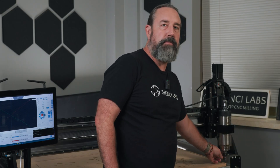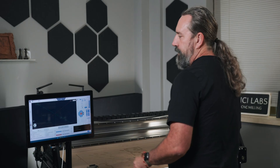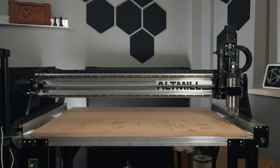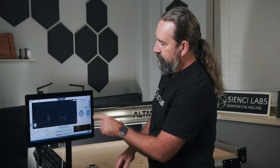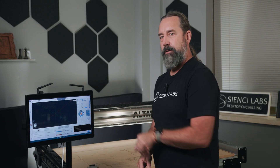This will be determined by the size of your bit. We have a 22 millimeter here — you may have something larger, one and a half or even two inches. Now that I've gone all the way to the right, I'm going to go all the way to the back. That's as far as I can go. Right now what it is displaying is my maximum extent that I'm going to input into the surfacing tool. Record these two numbers down. For me, it's 49.3 and 25.5 inches. In the next step when we get into the surfacing tool, these are the two numbers that we're going to input.